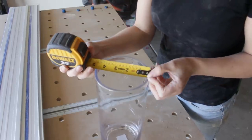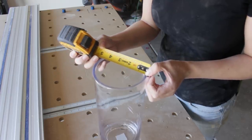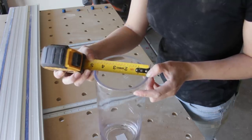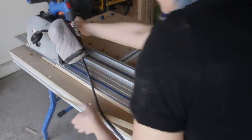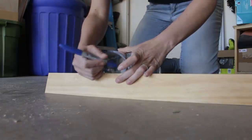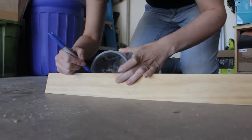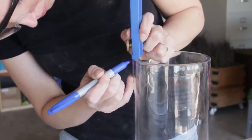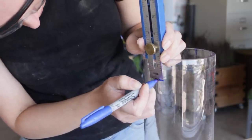The next step was to determine the exact width of the glass vases I was going to use for the terrarium. I hooked my tape measure on one side of the vase and swung it back and forth — whatever the largest number was, I knew was the diameter of the top of the vase. I needed to find the exact center on both sides, so I ripped a scrap piece of wood exactly one half of the diameter of the vase — which is the radius. I then laid the vase and the board on a flat surface and used a Sharpie to make a mark along the top edge, then transferred that mark down the side of the vase an inch and a quarter, giving me the locations on both sides exactly opposite each other where I needed to drill the holes.